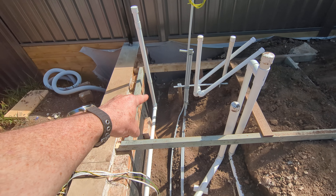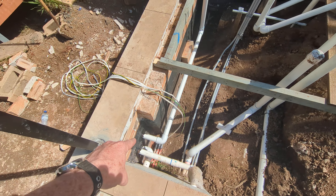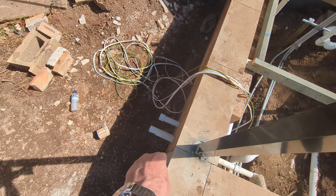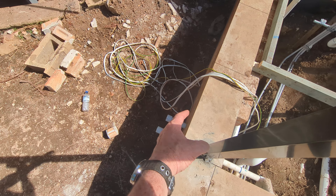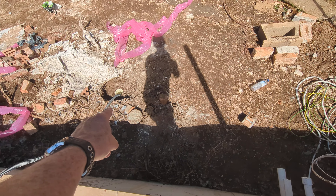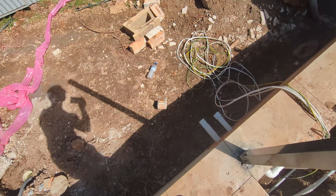We've got the waste pipe here — it comes out there and goes out here. Those will actually go into a drain out here, so they won't go into the ground; they'll fall into a drain pit. We're going to build a drain pit and that will go into the sewer over there through an S-bend, so that any smell doesn't come back up.